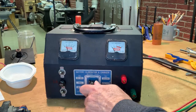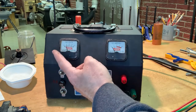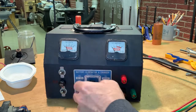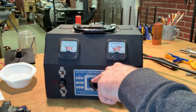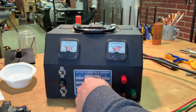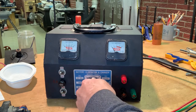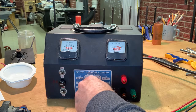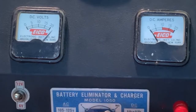Could it be. It seemed like before when I did this, when it came up, that meter was just jerking all over the place. But maybe that's more, is this a potentiometer here? Well, what it is, a contact sliding over the actual windings of the transformer. And so it's going from wire to wire to wire as it moves across there. And depending on how much oxide's on those wires and the pressure on the contact, it's going to do weird stuff. Wow, it went way past 20 volts.